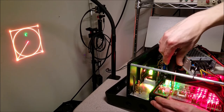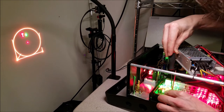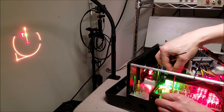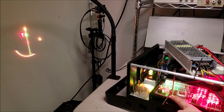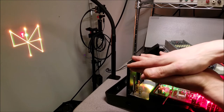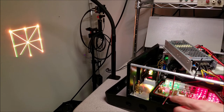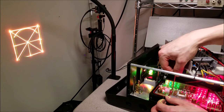That just means how much the material expands and contracts as it's warming up and cooling down. And when you have two different materials, the problem is that one material expands more than the other material. Hence things like bimetallic strips that bend when they get heated. Well, that kind of happens here, but what happens is that the brass and the aluminum kind of expand on top of one another like this. So one of them gets bigger more, and that can cause some torquing on the screws. Now, when you have torquing on the screws like that, because the screws want to rotate a particular way, you can actually make the screws creep a little bit, and using the same materials can prevent that creeping. Now, that's part of the problem, why these things come from the factory out of alignment.